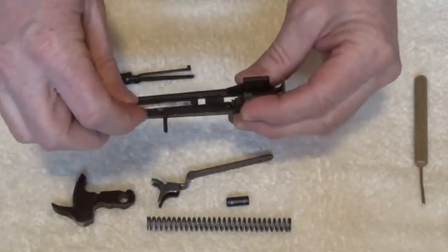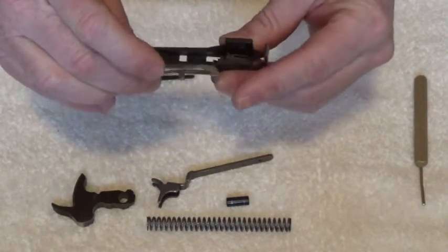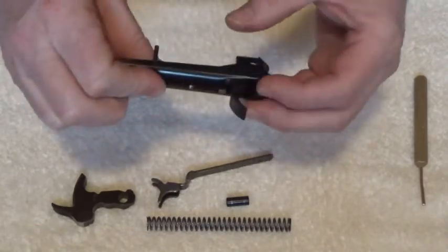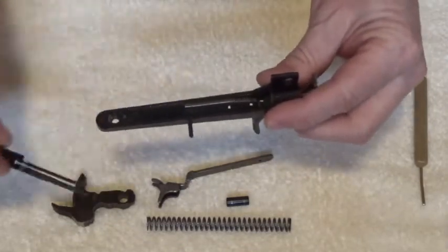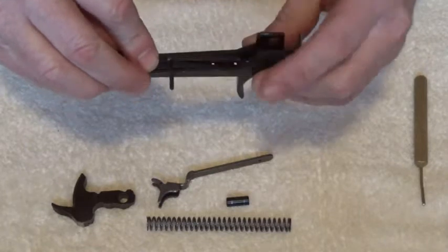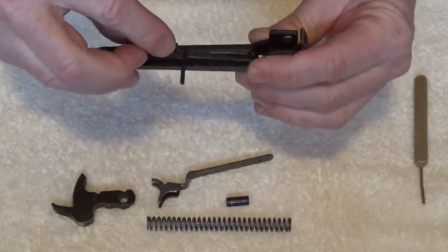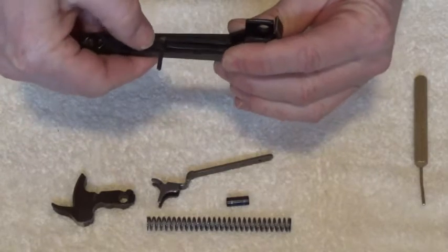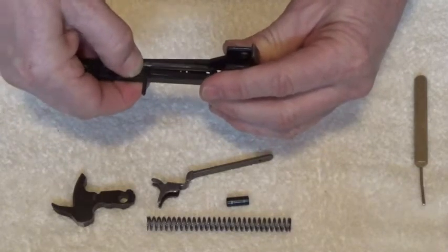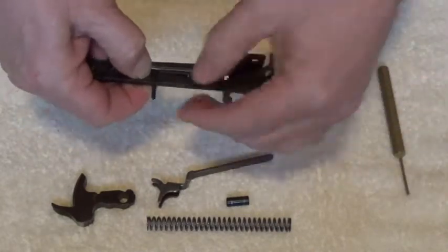The first thing you need to do is install the trigger stop safety, and that goes right here. There are two holes - here's the button, here's the safety - you set it right down in there, you can see it comes through the holes. Take your spring, make sure that the sear is underneath the tip of that spring. If it's not underneath the tip of that spring when you drive this pin through, you'll have to start over. Make sure that your sear is underneath this spring before you drive that pin down.